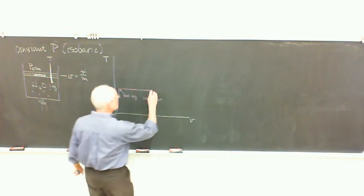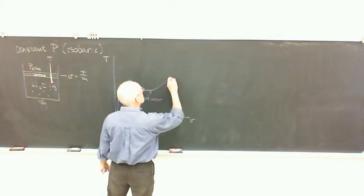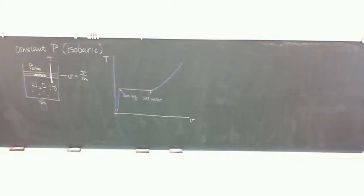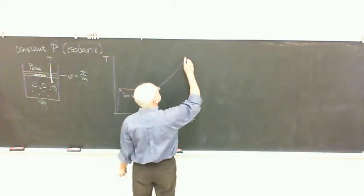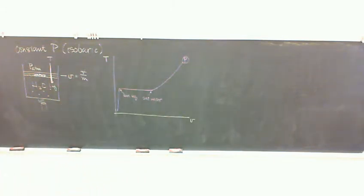So the line is not quite as steep, but we still get a pretty nice corner right there. And it tends to go something like that. It's got a little bit of a curve to it. And that is the temperature volume trace of a constant pressure process. And at any point along the way, if we turn off the system, we'll come right back down. One of the symbols we use, we'll put a P there and a circle. That means that's a line of constant pressure,